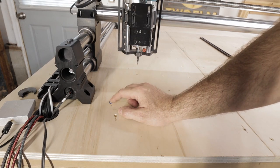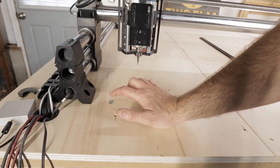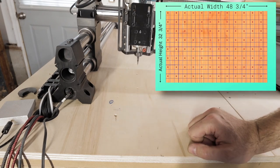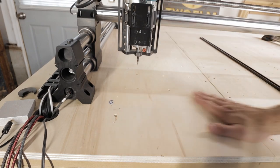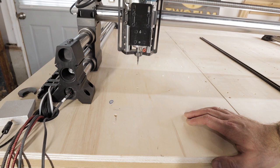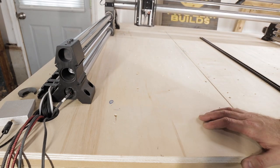That's where I know the exact corner is. Since I made my board a little bigger, you always want to have a little bit of overhang past those corners in each direction. I did 3/8 of an inch in each direction — 3/8 this way, 3/8 this way, and in the back 3/8 past those dots. I want it to be just a little bit larger than my surface area, but enough where my surfacing bit can cover it when it goes back and forth.